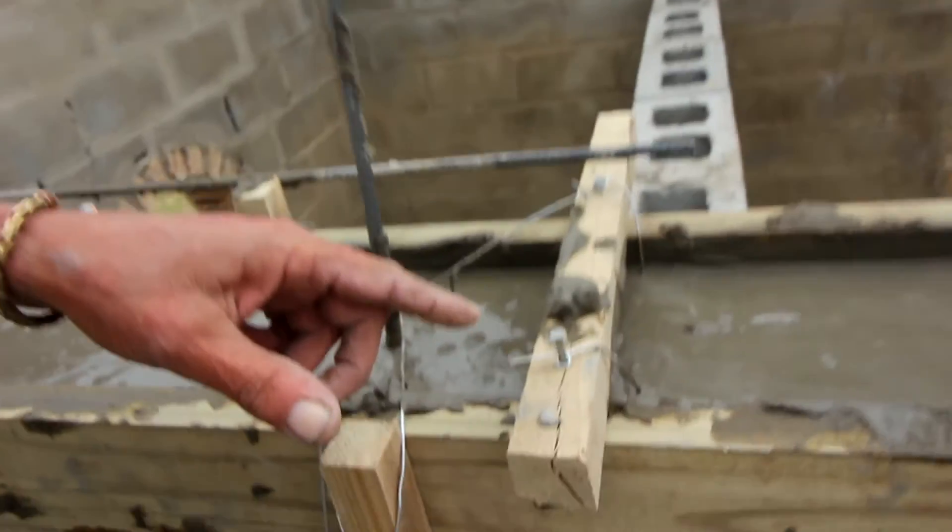How do I get the levels checked? I've got all these little pieces of wood all in the way here and I wanted to run a level along it. Then I realized, hang on, my boxing's level — I can just go according to the boxing. So I've actually made the concrete about an inch lower than the inside of the boxing, and that was a simple way to get it all leveled. I'm happy.